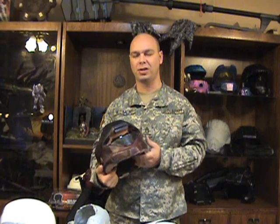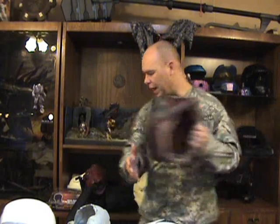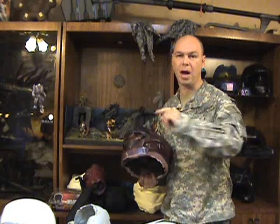Take your time in your mold. First coat very thin. If you get any air bubbles, that air bubble has a potential to get a tiny pinhole in it. If that pinhole gets in it, plastic goes in, hardens. You pull it out, you have a hole this big, but now you have plastic behind it this big. When you pull out, it's going to rip that hole even bigger, and bigger. Each time you make a cast, that hole's going to get bigger, and your mold is shot. So take that time on that initial coat, all the way up to the third coat. Try to prevent any air bubbles. Do not use any filler for helmets. Only, learn from experience, only for the box molds.